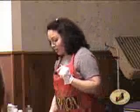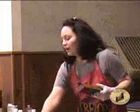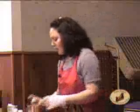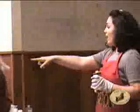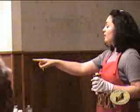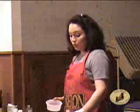That's what the guy wrote in the article. You really have to baste it. By the third time you wipe back, you've got most of it. You're going to come back because within two hours of me wiping that surface, you'll see the bleed back there. So you wipe with a cloth, again a lint-free kind of cloth, right?